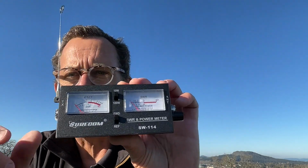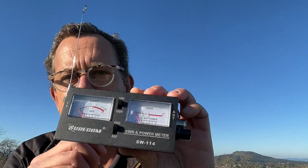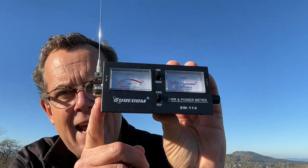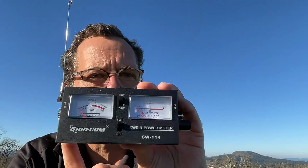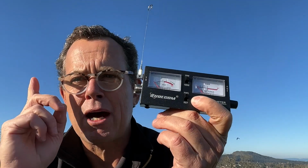And I want to shout out to Hollywood, Greg. He told me to get one of these field meters, and this is the SW114, and I'll put the link in the description below, guys. So essentially it's a forward and reverse SWR and power meter, but it's also perfect for testing the field strength of an antenna system. But we're going to use it today with my regular setup.